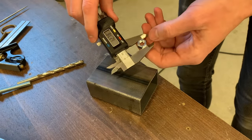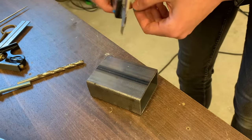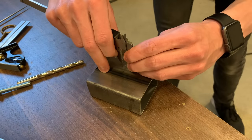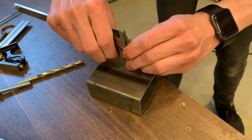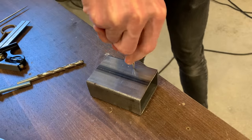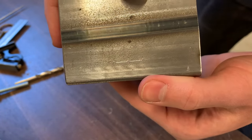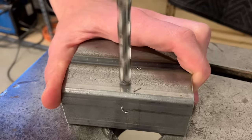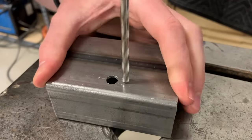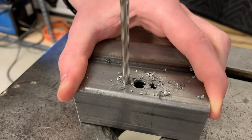This is a 13 millimeter hex, so half of that is 6.5 millimeters plus 2.5 is going to be 9 millimeters. Since these are very cheap calipers, I'm going to use them as scribers — I've got it set to 9 millimeters. Put one jaw in my center punch hole and scribe a line with the other. Don't do this with your good calipers. These outer two don't need to be super precise. The center hole is the one that needs to just barely fit the bolt, so you'll need to adjust that size for whatever bolt you're using.